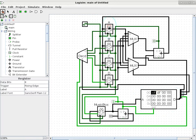So we'll put a 0, 1 into register A. We'll put a 1, 0 into register B. And then D can start with, let's put a 4, 0 into D. So these registers start with specific values. Once you have values in the registers, you can, quote unquote, probe this design and see whether the registers are outputting the right content or not.